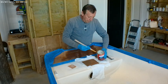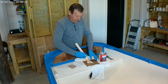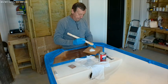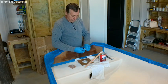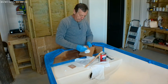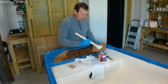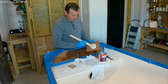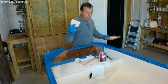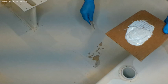I just used a small piece of cardboard to mix the Formula 27 on. Just put down what you think you're going to need. Then you put your hardener to it, which is really just a line across the top — about what you need. Mix it real well, then we're going to use a Bondo spreader and smooth it over your imperfections.